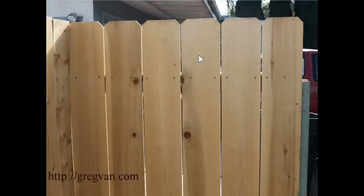Quick story: my neighbor was building a fence between our properties. I didn't have the money at the time for materials; she went and picked them up. I offered my assistance but she said she could do it on her own. She put new lumber fencing up with probably a 3/8 to a half inch gap between the boards because she thought the wood would expand when wet. She just didn't realize it was already fully expanded, and it shrank — we ended up with some nice big gaps in the fencing.